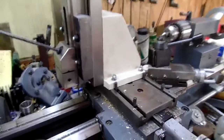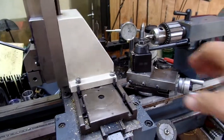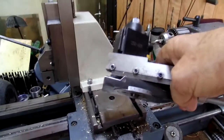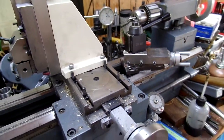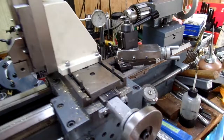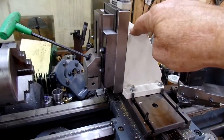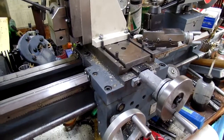Hi, my little Sony camera is giving me difficulties here. I made the four-bolt hold down from files in the 9 by 20 Yahoo file section. I machined the corners with a fly cutter on my milling attachment. In general I'm pretty satisfied with everything.